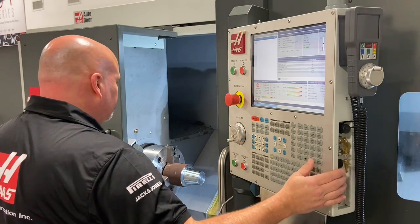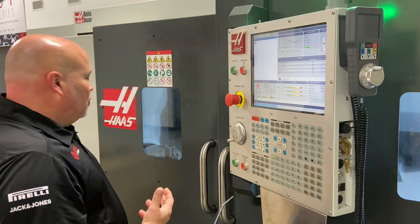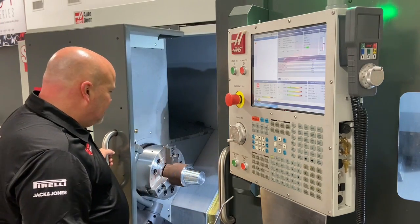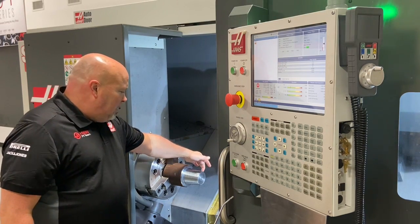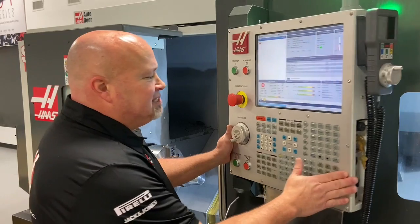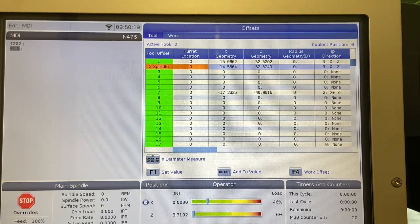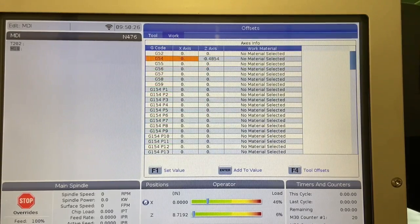I'm going to back the camera up a little bit, close the door, and cycle start this command. So we're calling up tool two and orienting the spindle. My spindle is now sitting at the orient position. I'll take the tool, line it up in that second thread back once again, but this time I'm not going to run the thread recut program. This time I'm going to go to the offsets page. In the offsets page, I'm going to press the F4 button to toggle to work offsets, go to my G54 Z reference, and press the Z face measure button. What I've just done is taken a tool of a known reference — tool two offset two — oriented the spindle, and taught the Z reference in G54.